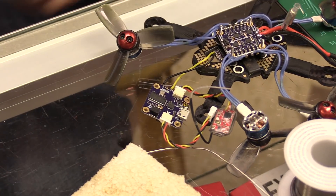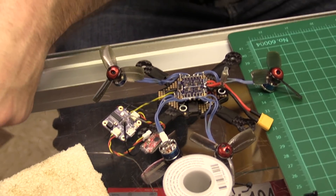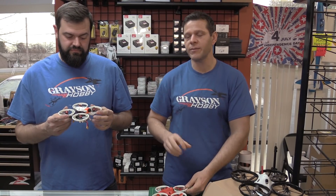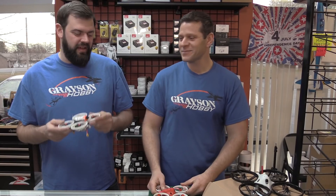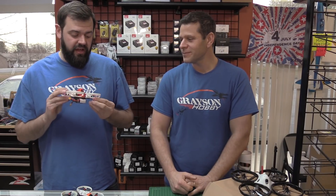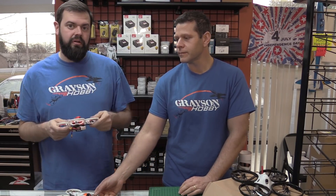So if you've seen our last video, we literally took the whole thing apart, physically flipped around the motors and the flight stack, because the way the mount is designed and the way the whole pattern is in the frame, you had to physically turn it around. So we're going to work smarter, not harder this time, and we're going to do what I was talking about in the last video — resource mapping — to reverse the direction of the motors and the gyro, so you can turn the camera mount around without taking the quad apart.